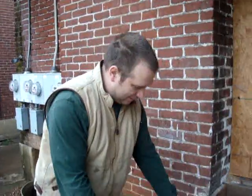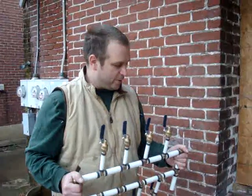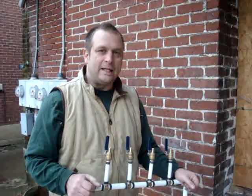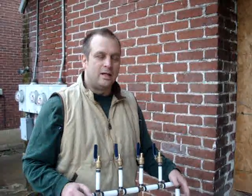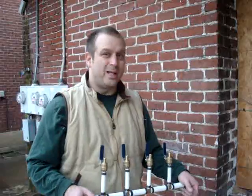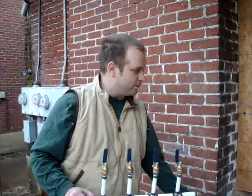Hi, I'm James Glass with James Glass Company and I want to talk a little bit about PEX. I use PEX pretty exclusively — PEX in combination with copper depending upon the application. We're here at my personal house in Roanoke, Virginia and I'm completely re-wiring, re-plumbing, restructuring. It's a massive renovation and PEX is a plumbing product. It stands for cross-linked polyethylene. It's not to be confused with polybutylene, which is a completely different product even though it's gray and a sort of flexible pipe.